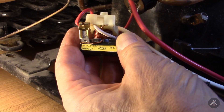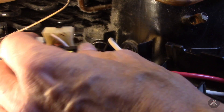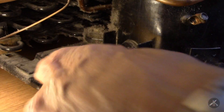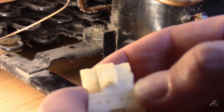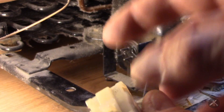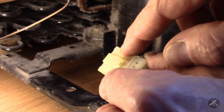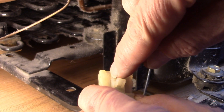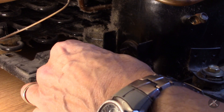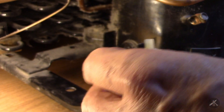There's the old relay right there - the red wire sits on it, feeding the compressor - and the white wire is on the top terminal, which is the common. According to the markings on top of this relay, it says M on one side and S on the other side, so it should be run and start on the windings, and then common on top - at least on this one.